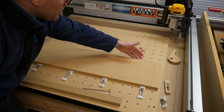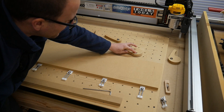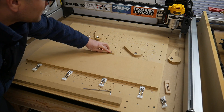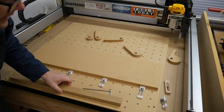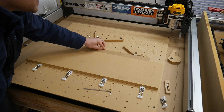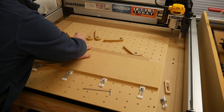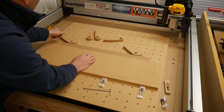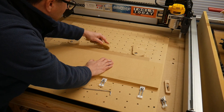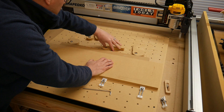You can see I have a row right here pretty close next to it and a row back here. The unfortunate thing is that my fatter clamps are too far away and my thinner clamps are too close. So if you run into that, I like to take a little strip of filler so you can fit it in. This isn't quite as long but it'll do the trick — so I'll fit that in here and here. You can see they're pretty good now, and the thinner ones will actually work pretty well.